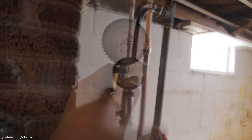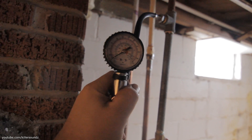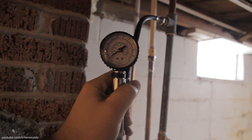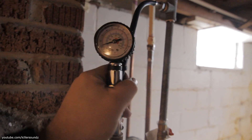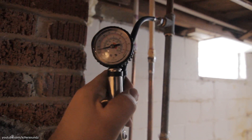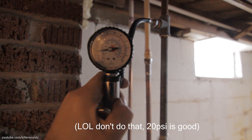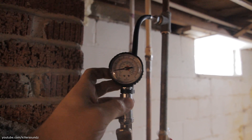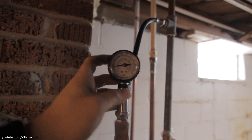I'm going to go ahead and pump it up. You can actually go more than you think with these. I'm going to go with 20 or 30 PSI. Almost at 20 there. I'm going to keep going up to about 30 PSI. This is a lot higher than the gas company tested it, but this line should hold that. Some people test it to 100 PSI — that's adventurous — but we're at 30 PSI. Now if you don't know where your leak is, you just sit here and wait and see if the pressure goes down over a period of time.